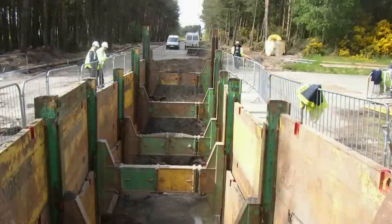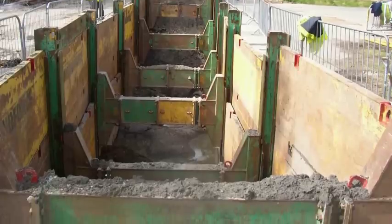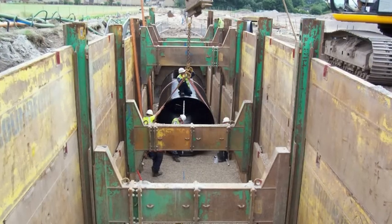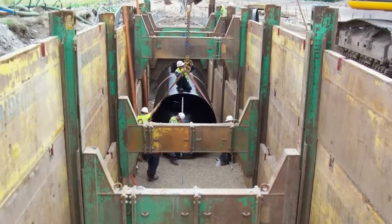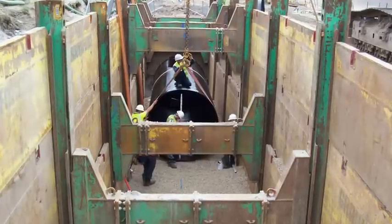The rolling strut slide rail is a versatile heavy-duty linear trench lining system capable of supporting trenches up to nine meters deep and 12 meters wide in most types of ground. The system comprises a series of posts and struts assembled to form H-frames, which are installed into the ground at four meter centers, into which plates are inserted to line the trench walls.